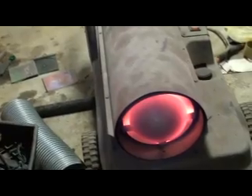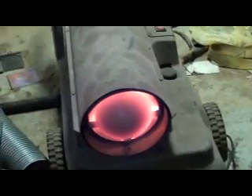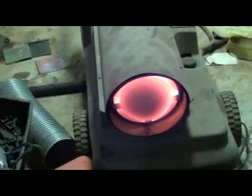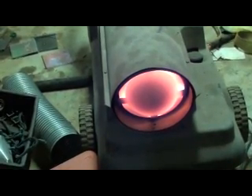Look at the flame up front — it's a nice flame. It's not blowing fire out the front, and it should warm that dome up cherry red, and that's exactly what it's going to do. We're about three-quarters of the way warmed up now. Now we have heat, and it doesn't stink. If you get one that stinks or burns your eyes, that's because it's running too fat — too rich. It's pumping too much fuel through and it's not burning it. Nice cherry red.